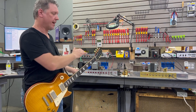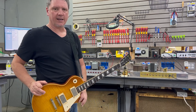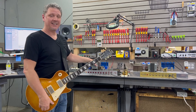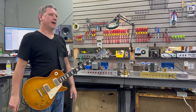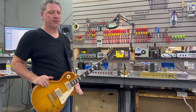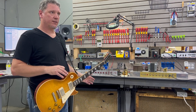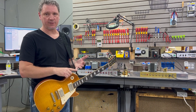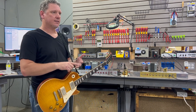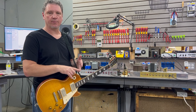I kind of obsessed over that. I'll illustrate it in some better clips. There are just a few other things: I intended to have this out months ago. There was something that had to be in here — a brand new master volume circuit that I created. This is a master volume circuit that's not a typical type you find in a Marshall. It's not a post-phase inverter master volume, and it's not a variation on any of the popular master volumes or mods that are out there.